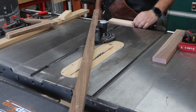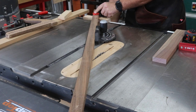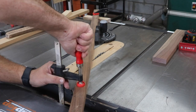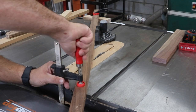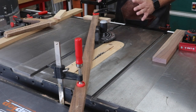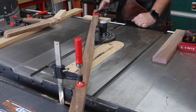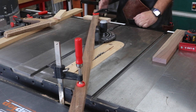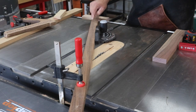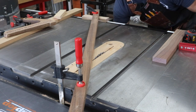With that makeshift fence in place, I can slide a spacer right in here between this tubing and the fence itself and clamp that into place. With this side clamped, I'm going to move over and clamp that side as well. I can already see I made a pretty easy and common mistake — I put my clamp on the inside. If you're running long pieces through, that's a no-no. Take this clamp off and move it around to the outside. That way when you're running your piece through, you're not getting blocked by your own clamp. With the fence in place and nice and secure, I can remove my miter gauge and I know that's exactly where it needs to be.